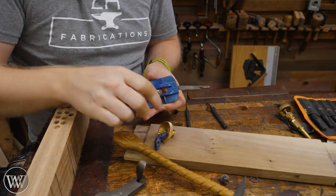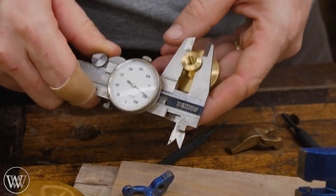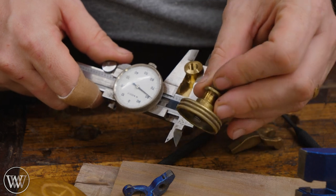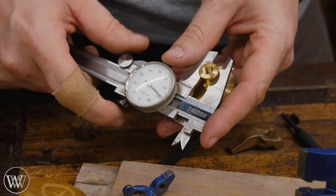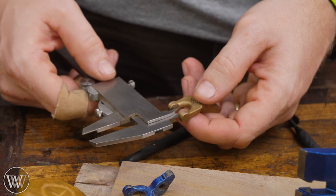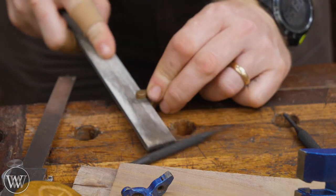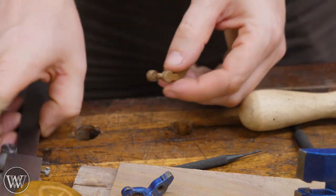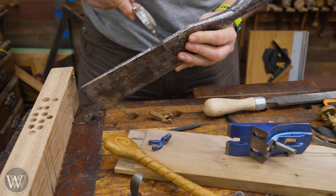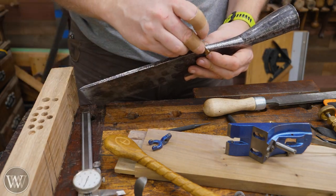Now with the frog removed and all the parts out, we need to do some adaptation on the yoke before we go any farther. First, we want to measure the inside diameter of your adjusting screw — especially if you're using an antique one that may have worn down over the years. Mine is 0.379. Then I want to make sure I have at least that measurement on the yoke. If the gap is too small, you can take a file and widen it out a little bit, taking a few shavings off either side and then checking it again.